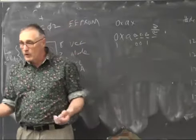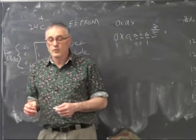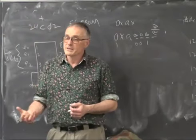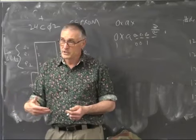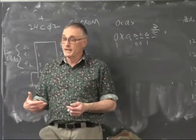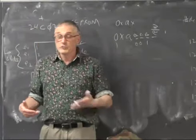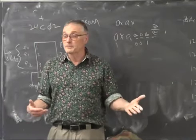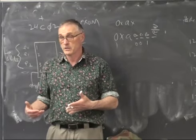Yes, because this is running at 400 kilohertz. And so you may find that it's worthwhile either putting the Mega to sleep to save power during the bus transaction, and by the way, you can wake up on the interrupt from the 2-wire interface, or go do something else and wait for the interrupt on the 2-wire interface to come back and say that the transaction is done.